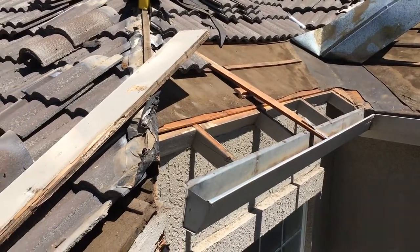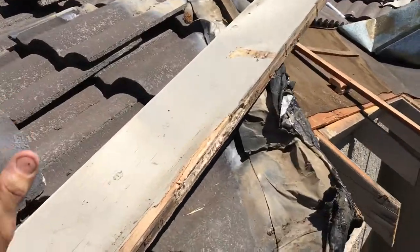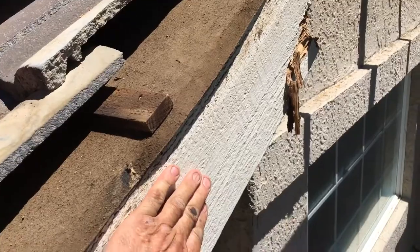July 18, and I've taken this fascia board off — not the barge rafter, this one is the barge rafter, it's a 2x8. So now that the fascia board is off, I can cut back this barge rafter to the next outrigger, put a nice 45-degree angle, and put the new board on.